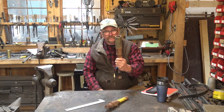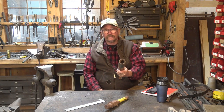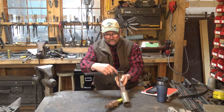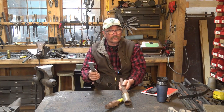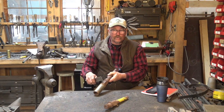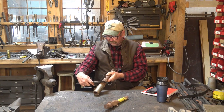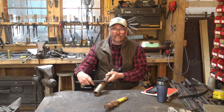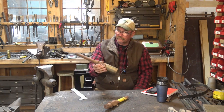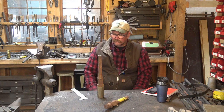Larry in Burt Burnett, Texas sent me a couple of big flat rate boxes full of sucker rod bits and I've never seen sucker rod this size. Around here all you get is the three-quarter inch stuff. This is a one-inch diameter rod — the three-quarter rod we get only has a square coupling section of one inch, but this is just a hair over an inch and a quarter, so it's going to be perfect for my hardy hole. We're going to use a piece of this sucker rod to make our scroll starter.